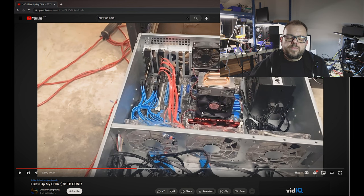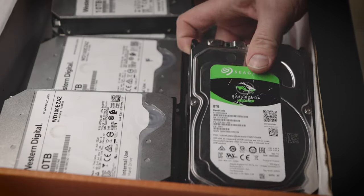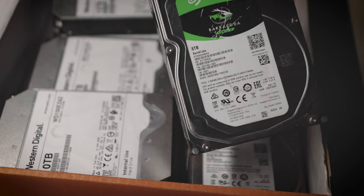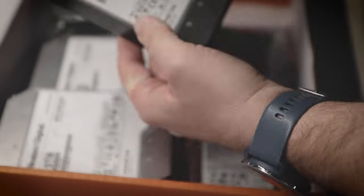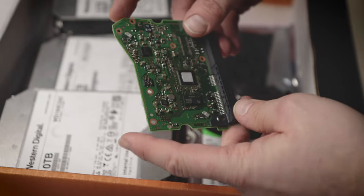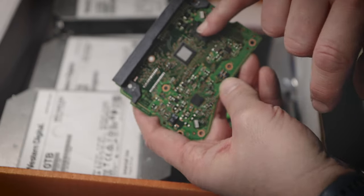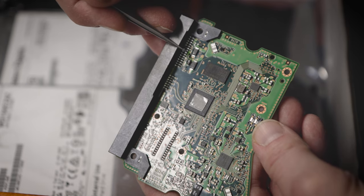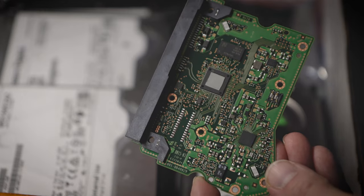Here are the drives I picked up from Darwin. I had a look at this drive so far - one of the diodes was shorted out. I removed it, but unfortunately the drive still doesn't respond, so there's a good chance there's another fault on the board I haven't found yet. I'll put this one aside for now. Then I tackled one of these Western Digital white label drives. After removing the board - first thing I did was plug it into PC-3000, and all the control lights were grayed out, meaning the board is faulty. I checked the diodes - they were good. But on these boards there are also two fuses. I found one fuse was blown, so I replaced it. I plugged just the board into PC-3000 and it shows busy now because the drive isn't attached yet.